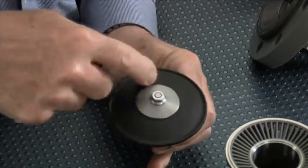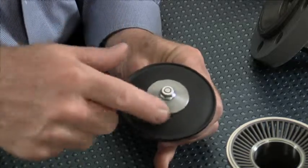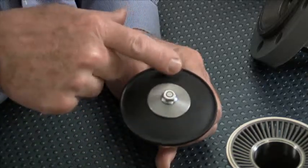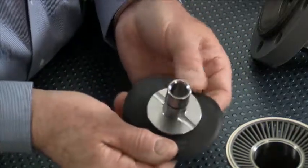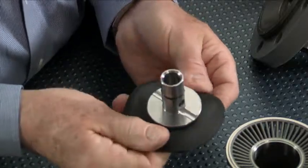You'll notice that there's a ring around the center plug here — that's where the knife edge seat goes in, and that's very customary. If this has been in very high pressures, you'll also see some indentations from the window, which doesn't hurt it either. We would also like to take a look at the back side of this and make sure we're not getting any blistering on the diaphragm.